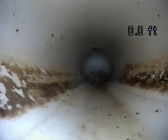This is either a clean out that we're seeing on that coming into this line, or that's a neighboring line. And since there's two houses on the circle, that might be the neighbor's line, and this one's yours, both feeding into the city connection. And that wouldn't shock me because you have a different type of PVC here, and so that's a definite possibility. Since I wasn't sure, though, I wanted to push it out as far as I could get, just to see if I found anything else wrong in the line.